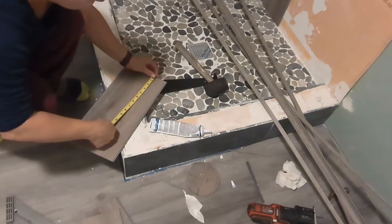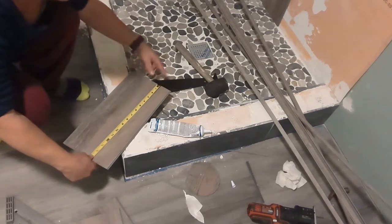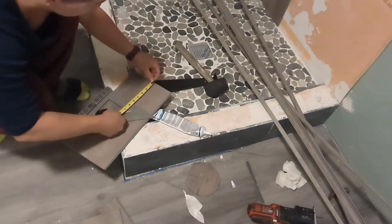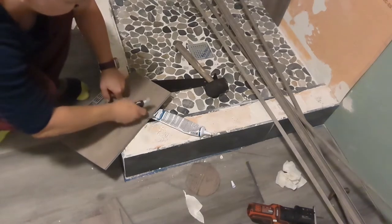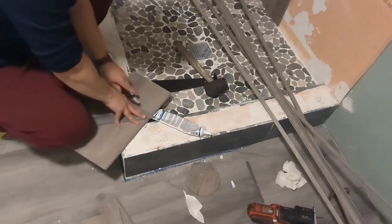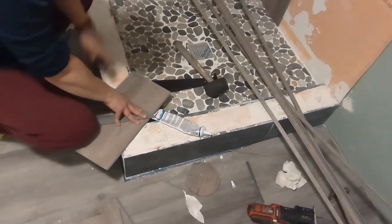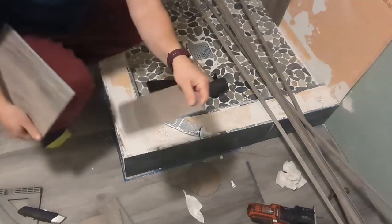To cut them, you take your measurement and figure it out. In this case I'm cutting about five inches. Make sure you're cutting the right side — I need the flange on these two sides and the top, so I'm cutting five inches down. I find using a speed square really helpful. If you get a really good score the first time, you don't need to score it multiple times. You take this, get your score mark, and it breaks off like that — very easy to do.